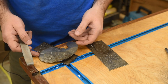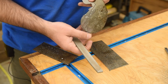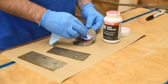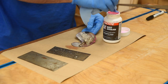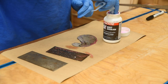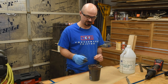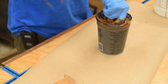I tested these with some liquid and they're not hot anymore, so now I can start removing all the dross slag flaking from cutting. Before I get any further, I'm going to clean these up with some naval jelly. If you want a less caustic method, you could just soak these in vinegar for a while — this works a lot quicker. You can pick this stuff up at Home Depot. I'll just let this sit for a few minutes and then rinse it off. The naval jelly wasn't doing much to remove the paint, so I put it in some white vinegar and let it sit over the weekend.